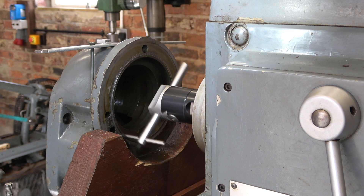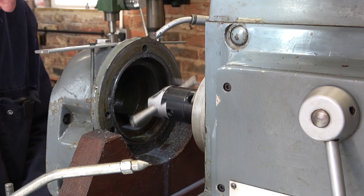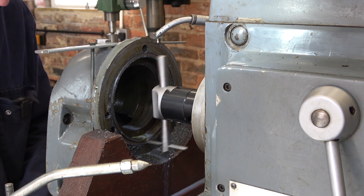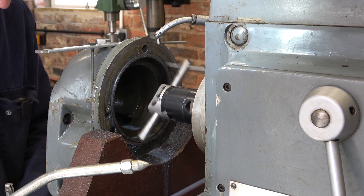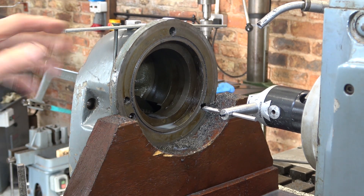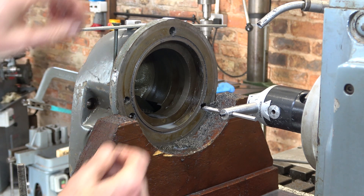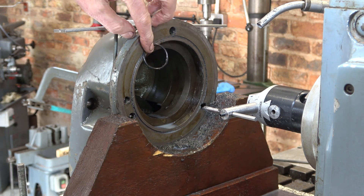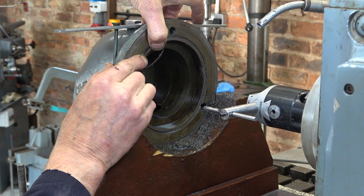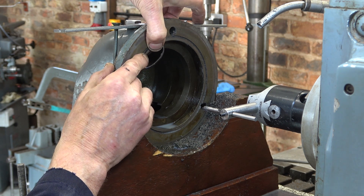It's almost better with a bigger cut, honestly. I'm just measuring up to see what we've got — my dial says 1.6 deep, but when I measure with the calipers it's more like 1.3. But there's the 2.5 mm o-ring. The signs are quite good; if we can keep this up it's going to work, against all odds to be honest.